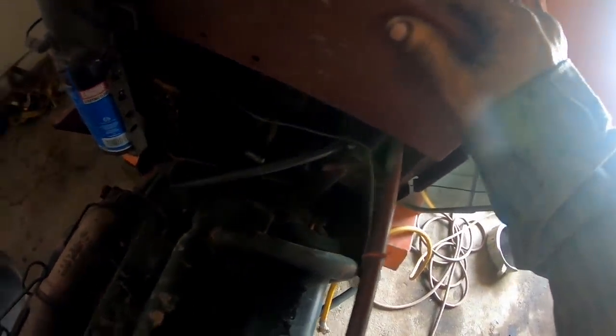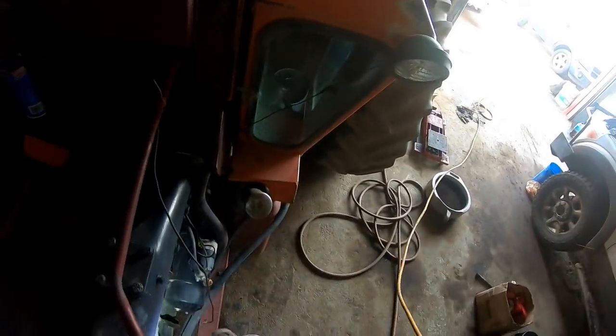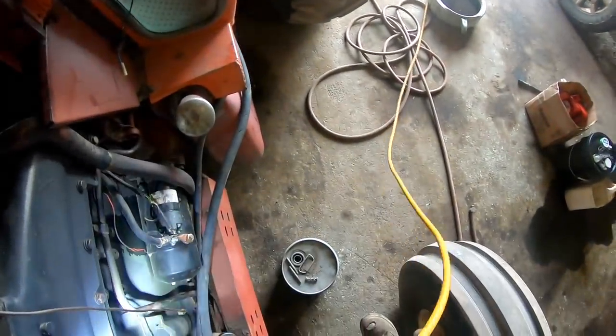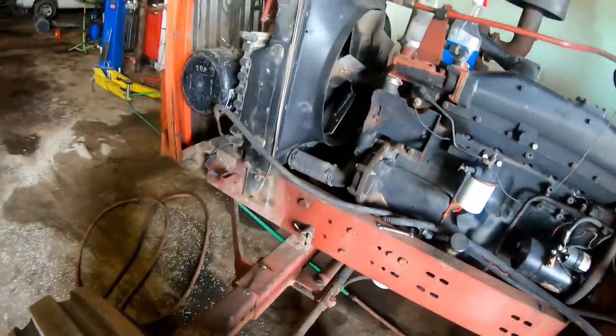So, the intake manifold bolts were loose on it. I retorqued them all, and it still was doing that whistling noise. So what I did, I pulled the ether injection part out of the intake manifold, took a rubber tip blow nozzle, and I know I need to go make a special hose for this too, probably, but I squirted some WD-40 in there. Look at that. Can you see that? Look at the bubbles coming out there. The intake manifold needs to come off of it and be resealed. There is where our whistling is coming from.